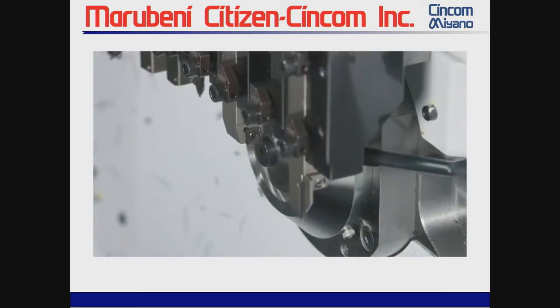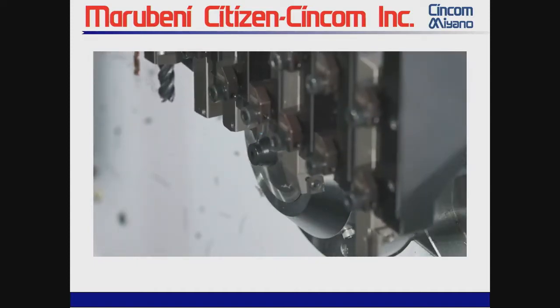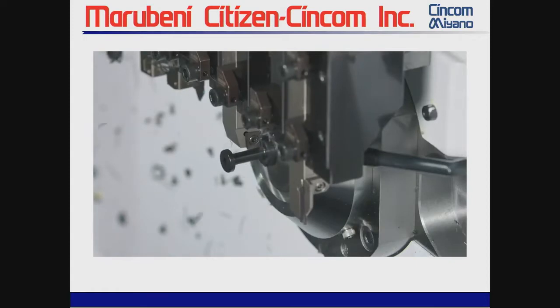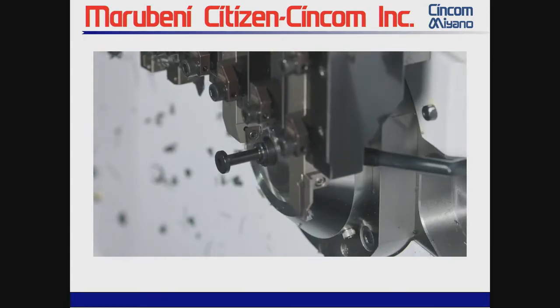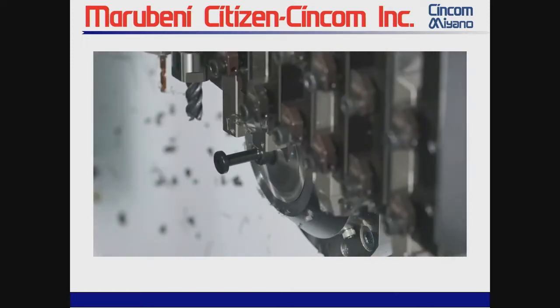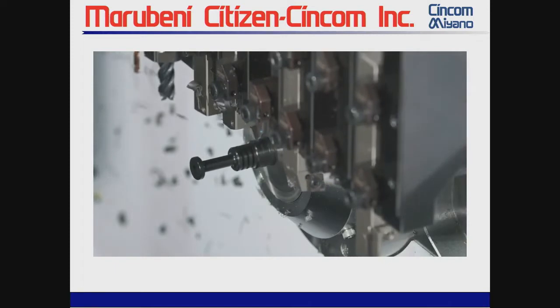Turning, same process, very controlled chips. As you know, machining plastics can be very problematic, creating a real bird's nest. This isn't only limited to plastics, it can be used in all types of materials. See how the chips are just flying off there, very small, very controlled. This works really well, as you can see in a second with grooving. Grooves can be very problematic with chips wrapping up in the grooves, difficult to get rid of them.